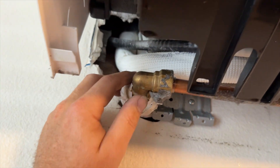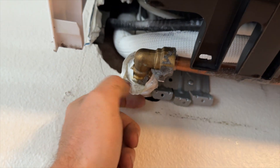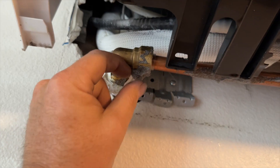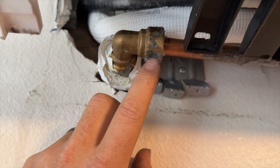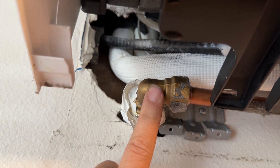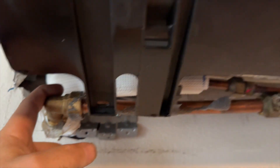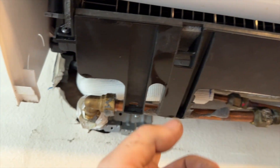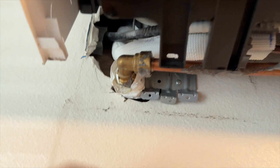The last one I did was really hard because it was deep in the wall. I braze in a new piece and just run nitro. These things are terrible — some had them up on the roof which were easy to get to, but every single one when it has a leak it's on this stupid fitting. I'll never use these. If you're going to use them, at least put them somewhere accessible. This one I think I can leave in place. The nice thing about these LGs is they have a little clip that holds everything out of the way and can also act as a stand to keep it off the wall.